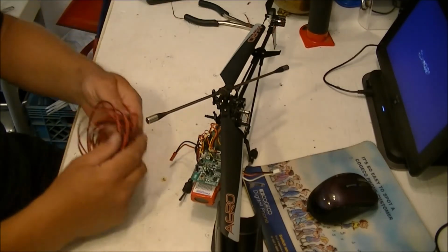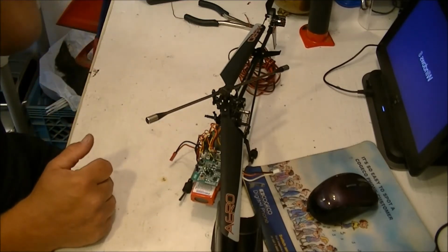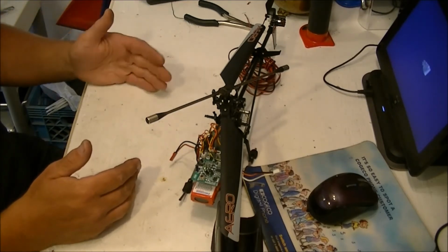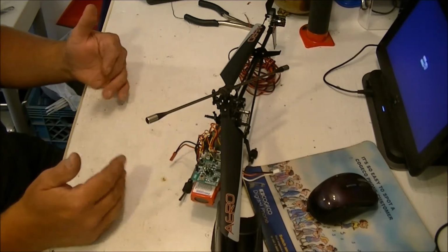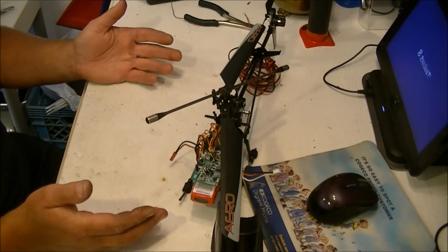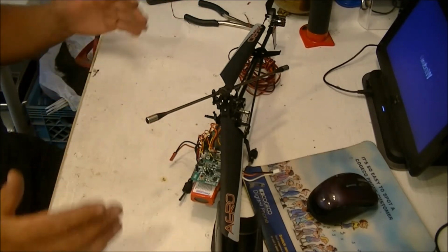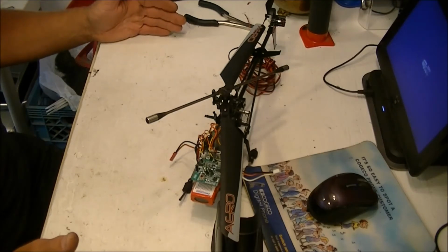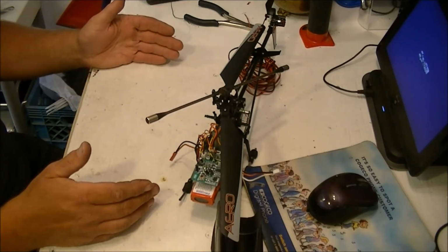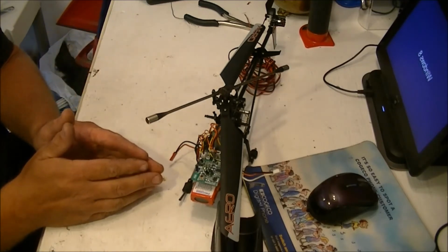And then we're going to take the same stuff in this speaker wire, which is thicker, and it's got a few strands shy of being 14, so double. Okay, so it's 11 strands, and it's thicker. So at 11 strands, slightly thicker, we're looking at almost 20 strands worth by the time you're done the math. Okay, and that's going across, you measure it the same length, that's going to give you a lot of increased range just being at the same length. Even if we cut it in half, for half the amount, we're still increasing range because we're already more strands and thicker wire. So let's chop that length back again and half again.